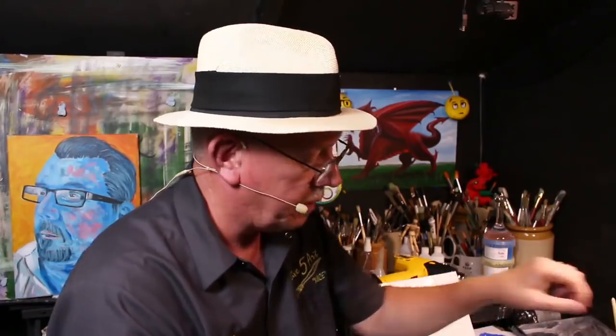Basically, all we've made there is a PVA glue and water emulsion. Polyvinyl acetate is a very, very useful thing. You can seal fresh plaster with that, or any wood with that, before you want to paint on it — highly recommended in the studio. You've saved yourself a lot of money. So thank you very much for watching this lesson on how to make PVA sealer for your woodwork.